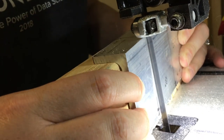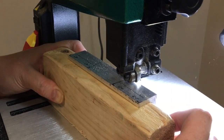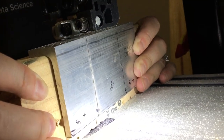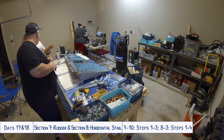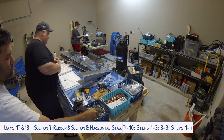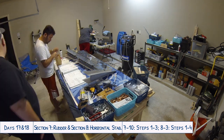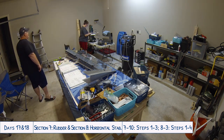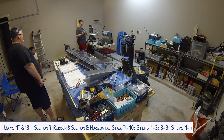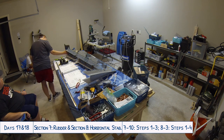With the bracket upside down, you cut along the back first for the full length — it takes a while because you're cutting through quite a tall piece of metal — but that gives a nice flush straight cut along the back. That then makes it much easier to cut down that angle from the back to the front. This seemed easier than trying to measure on the inside of the bracket or cut along the inside because of the curvature on the inside corner. Just fair warning: the pieces will be really hot when you're done cutting, so don't just grab them.